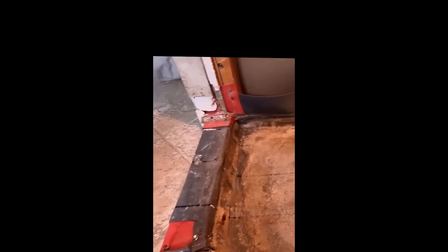They didn't waterproof the pan. It was ridiculous to waterproof all of this if the pan wasn't waterproof, because the water's going to wick up and do what it does. You can see clearly they put the bottom flange on top of the subfloor. But I've talked about pre-slopes before. That's where your pre-slope would have started, had those bolts been sitting on top. And we don't do water in, water out systems anymore. So it was kind of, well, that's kind of stupid. It should have been a taper cut to match up the taper cut of the bottom flange.